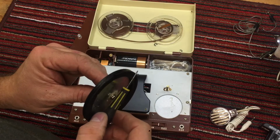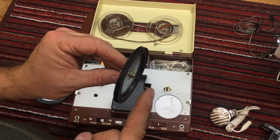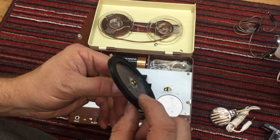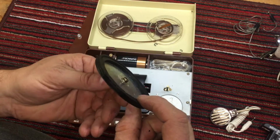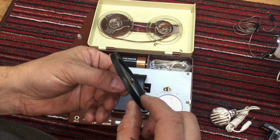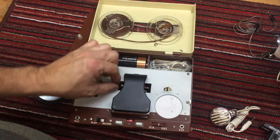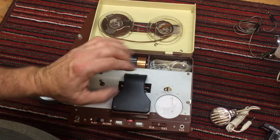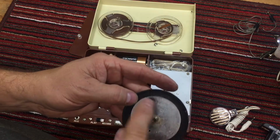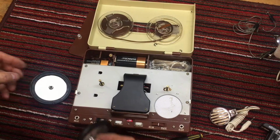Another big issue we've got is that we need to make sure that it's flat, and it is not. I don't guess that it would change the wow and flutter too badly if the thickness was a little different. A little inconsistency of the thickness of the tire, so that it's not riding up and down, because the motor is forgiving and the motor will ride up and down on that tire. But we sure can't deal with these notches. That's definitely not going to work.